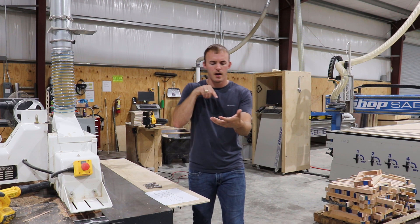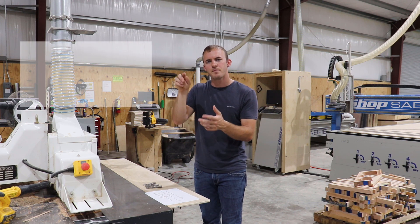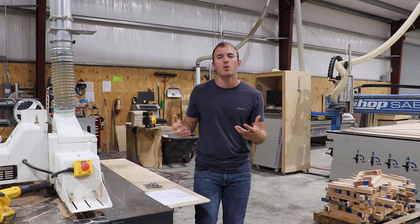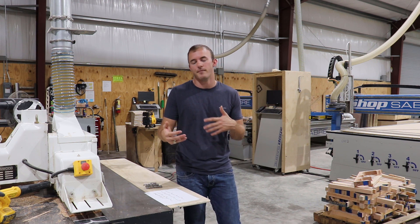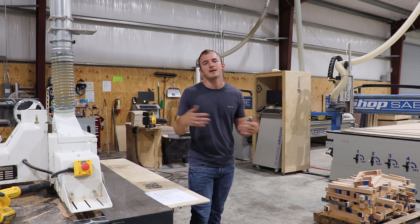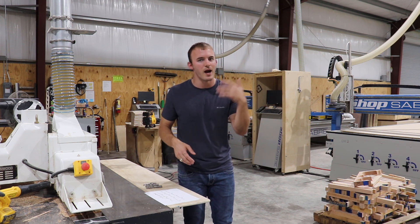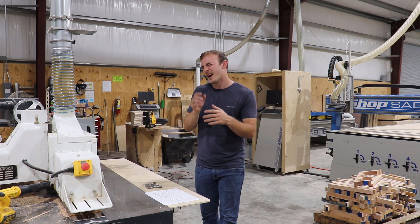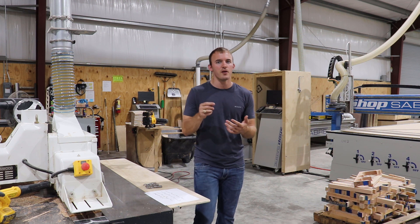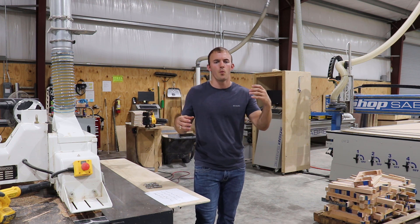I've personally used it for pocketing out plywood or making a big bowl. You know that bird's nest that gets made when you're going back and forth on pocketing and you get all these little frizzies? The chip breaker's little serrated edge cuts those fibers so you don't get that bird's nest on your project. I'm not going to show it running on my CNC because it looks like a smooth cut — same as a finisher — there's nothing crazy to look at. But for companies that don't have an automatic tool changer and just need to run a single bit faster than a finisher can go, the chip breaker works perfectly.